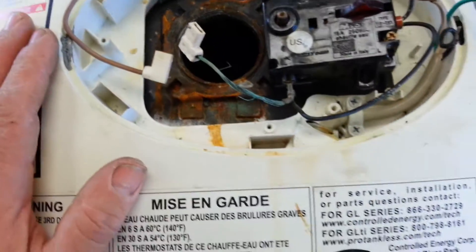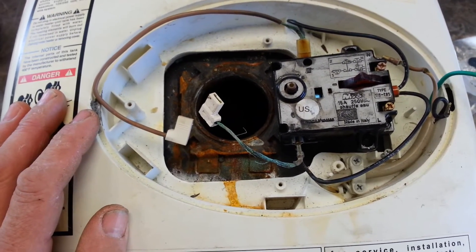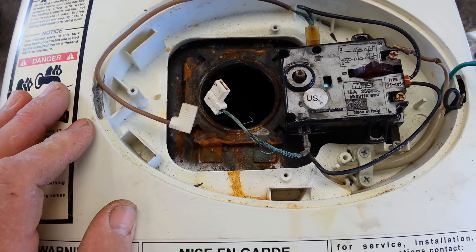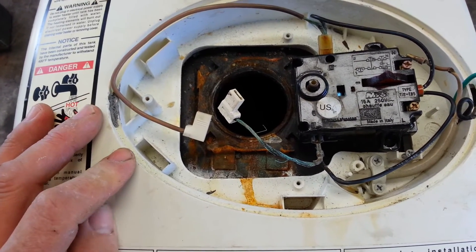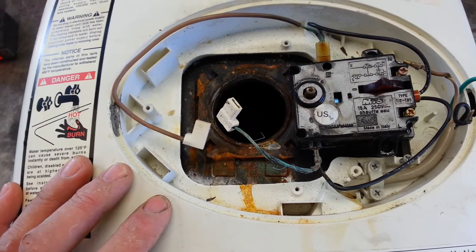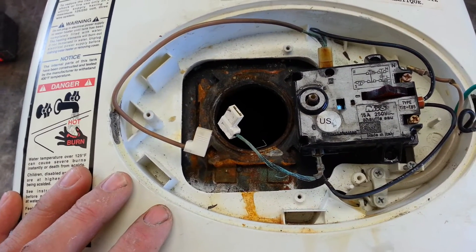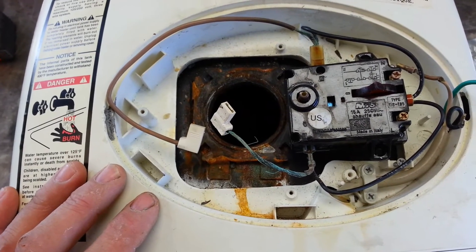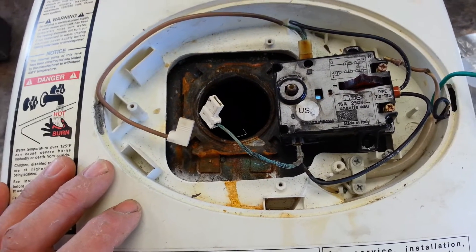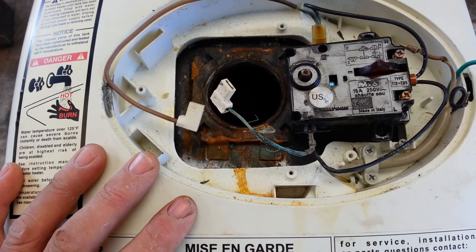This is used as a secondary unit to my tankless water heater in my home, just for a very small amount of hot water storage to run the recirculation comfort system. The Grundfos recirculation system didn't move enough water to trigger the tankless water heater — a Rinnai eight gallon per minute unit whose minimum threshold is about 0.35 gallons per minute. So this keeps a very small supply of hot water in reserve to run the recirculation system.